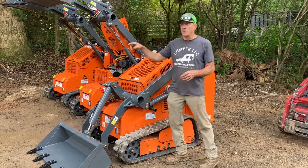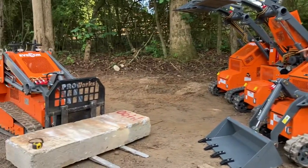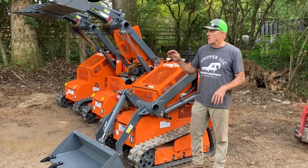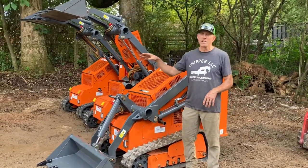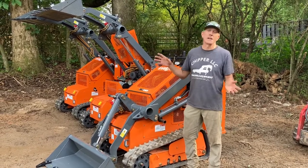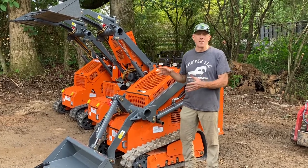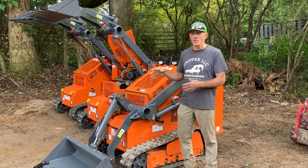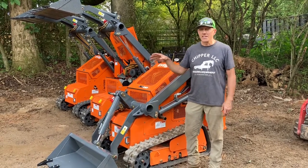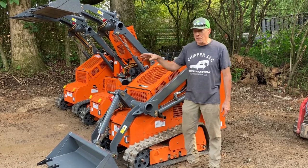We did some testing — there will be a video at the end. There's a 1,490-pound block over there. We handled that block and also moved that block plus another 570 pounds, which would simulate 2,060 pounds on the job site if you just got to move something around. 1,490 pounds on the forks — that's going to pick it up and move it around. That's beyond what they would call your safe operating capacity, but it will get it up and move it around.